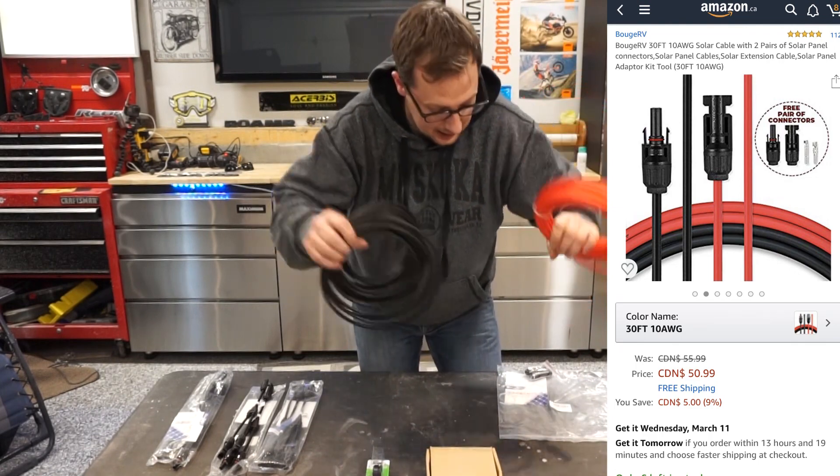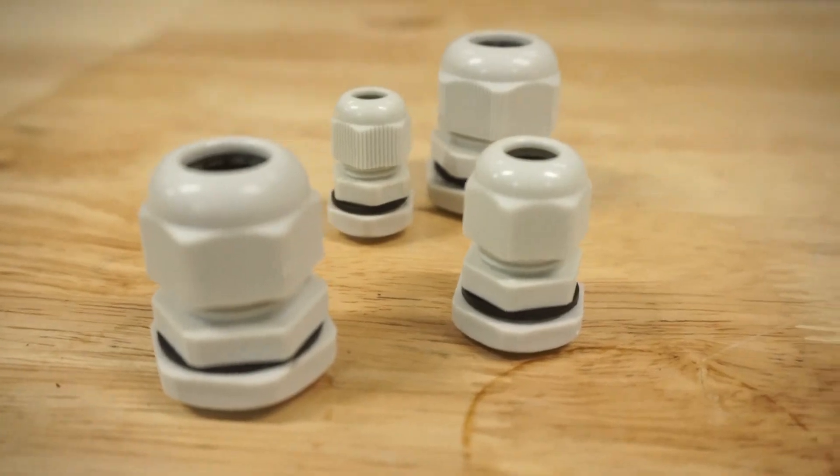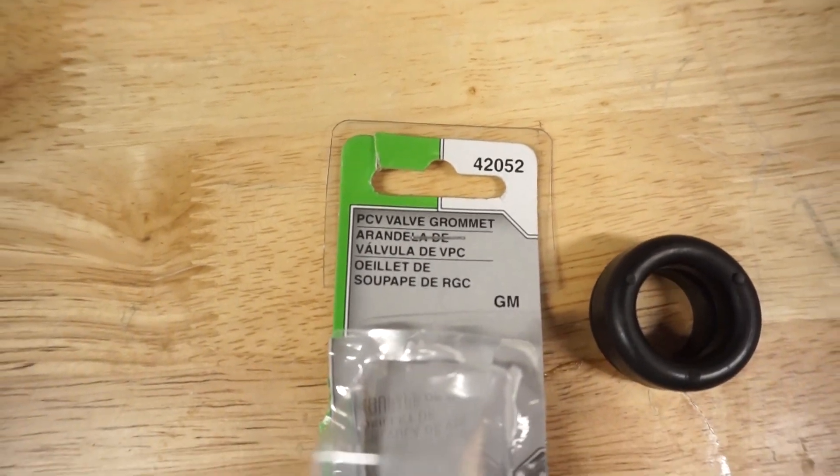After the Y connectors, we're going to need a positive cable and a negative cable, which is our 10-gauge solar cable made for being on top of your roof. To mount these wires down through the roof we need a waterproof enclosure. You can go with a simple one that already has two wire holes sized for solar panels, or a completely sealed enclosure where you add your own holes and seal nuts in different sizes for your wire gauge. You'll also need a rubber grommet — I used one from a PCV valve off a car — big enough for the wires to go down through.